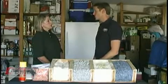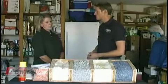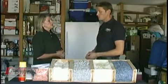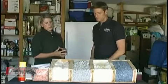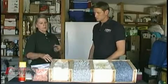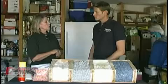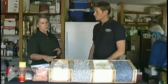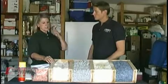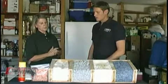People can call us if they have questions on how to address some of those things too. Now that we've fixed the air leaks, the next thing you need to do is check your insulation — find out how much you have and what type. Typically if you have a joist in the attic and fiberglass batt, that's going to be a 12-inch cavity, giving you around R-38 minimum insulation. You need to make sure that your joists are covered with insulation, because that's a heat sink and through thermal bridging you can lose heat.